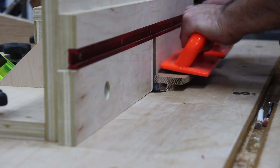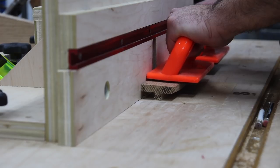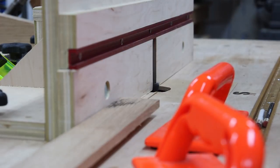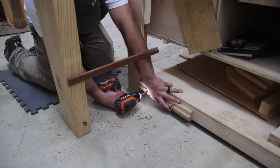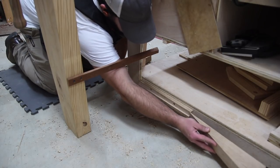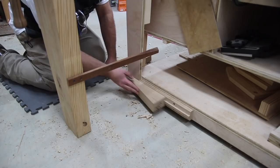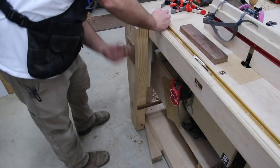Once I've found the right fit I can take the edge pieces off - this is going to be one tail, the tail part of the dovetail on that piece of wood. Some of you might say stepping on it could break it, but once I get used to it in the shop I'll know it's there. All I have to do is install this to the lower shelf and it's ready to use. Now I don't have to keep track of a scrap piece of 2x4 - I can just slide the wedge back and forth with my foot, which is very convenient.